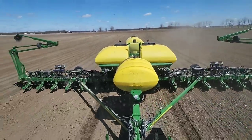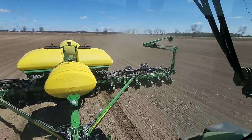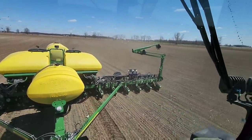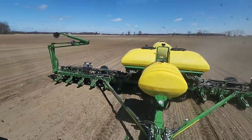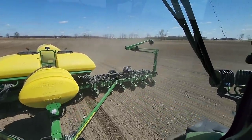I got them about as good as it gets - a couple of my metering tube valves were not set quite right. That's good - that's why it's important those are working and we can see them. I know they were all getting fertilizer before because the balls all floated straight to the top, but we weren't necessarily getting them even. Now with those heavier balls that don't just float straight to the top, we can actually see them.